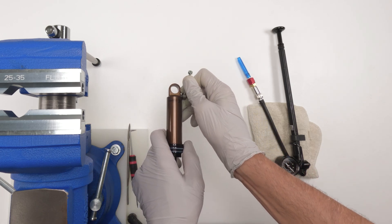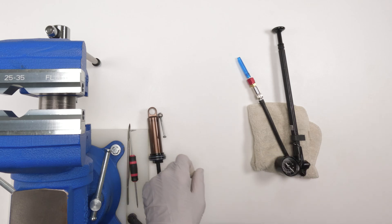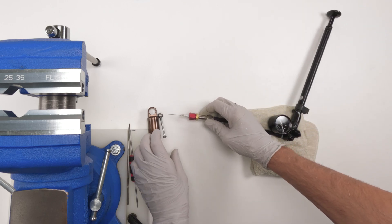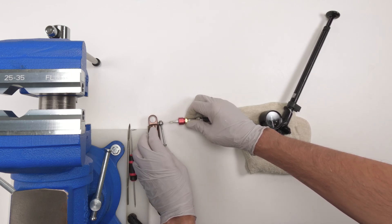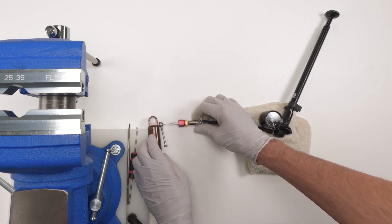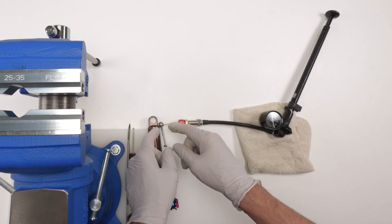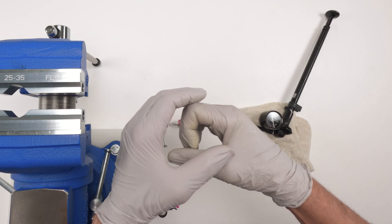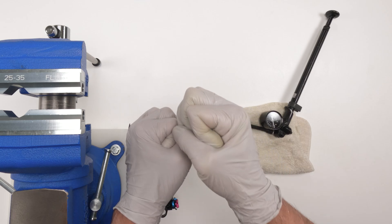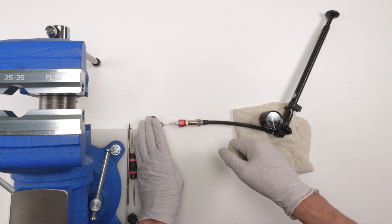We had shut down our bleed screw and opened it up about an eighth to a quarter turn. Now we have our system connected. Before I actually insert the needle, let me explain the workflow: we're going to insert the needle, then tighten it back down pretty hard — nearly all the way but not completely — because the way the pellet works, it gets squeezed by pressure. When we put the needle in it creates a hole, but when we put pressure on that pellet and remove the needle, that hole gets squished together. That's literally what stops it from leaking.